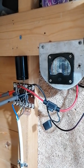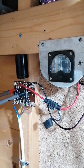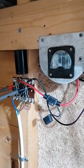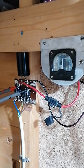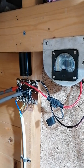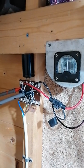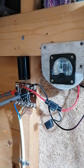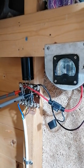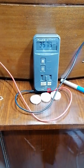I still say: tread very carefully if you're thinking about buying one of these things, because to the tests I've done here, it doesn't work. The standard type does work — it would be better in an environment that is less built up with less turbulence, but I did get output from it. On another occasion I was getting a good 10 amps off it. But not when there's a lot of houses around, and there's a tree around the back. This thing is advertised as working in turbulent conditions, so it is not to the description, not to the advert, and not to the specification they claim. Thank you very much guys for looking. All the very best. Bye for now.